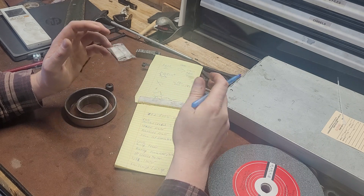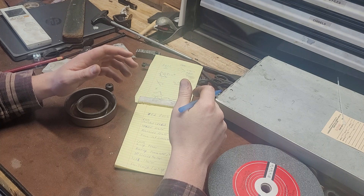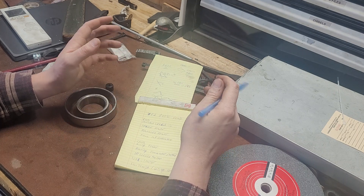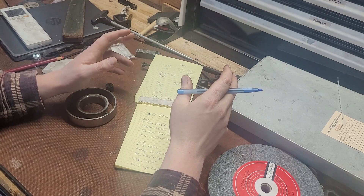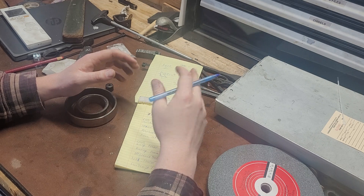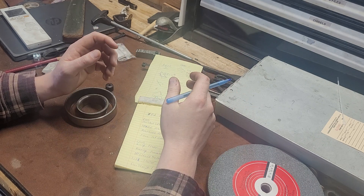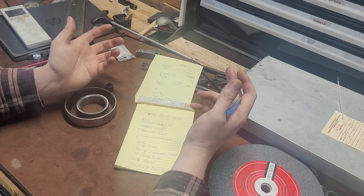One thing too — you can only run one motor at a time off a VFD. I've seen guys wire up a VFD so they can run two motors with a cutover switch between them, for a mill and a lathe, so they only have to buy one VFD. With the cost of VFDs, I don't really understand why you'd want to do that, because you can get into situations where you cook the VFD or you cook the motor.